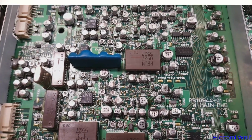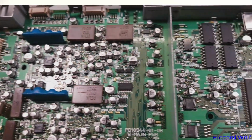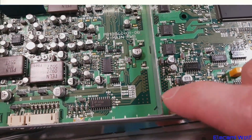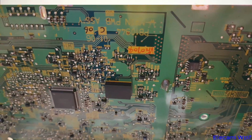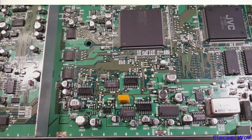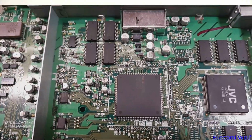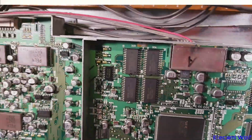Have a look over this board. And then the other side, see there's guard track around the top and the bottom of it, and then tracks that go between the boards are going on internal layers. See on the bottom there, they're not traveling across the bottom, they're going through on an internal layer. So there's the other side. And there's a connection up there.